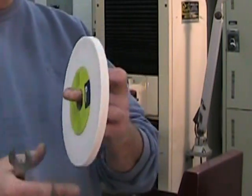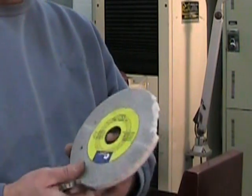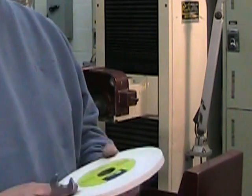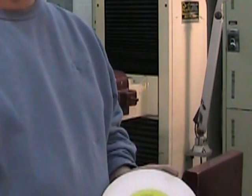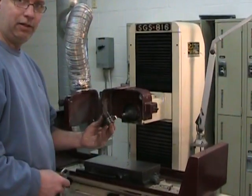We can see that we have a nice crisp and clear ring to the wheel. If we compare with a wheel that is clearly broken, we'll hear that the sound is quite muted. So it's important to always verify a grinding wheel by ringing it before you install it on the machine. Obviously if you don't have that nice crisp clear sound, don't install it.